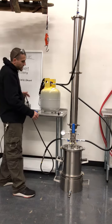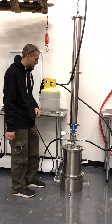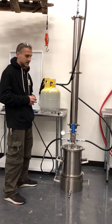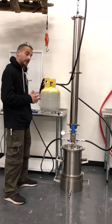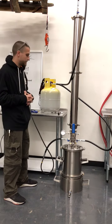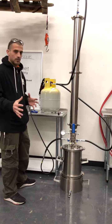Once you've reached an ultimate vacuum per your altitude — and that can vary — you may not be able to reach a full 30. So just hop on Google, look up your elevation, and find out what your ultimate vacuum possibilities are for your elevation. You may only reach negative 28 Hg. Don't freak out, it's just the way that elevation and vacuum works.